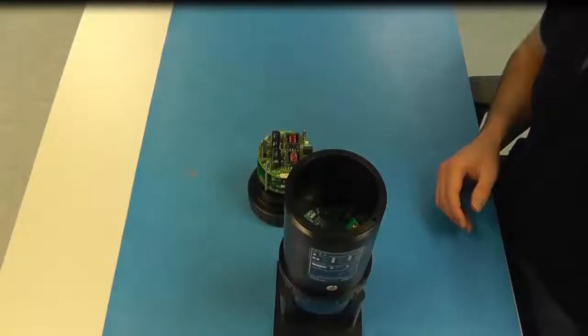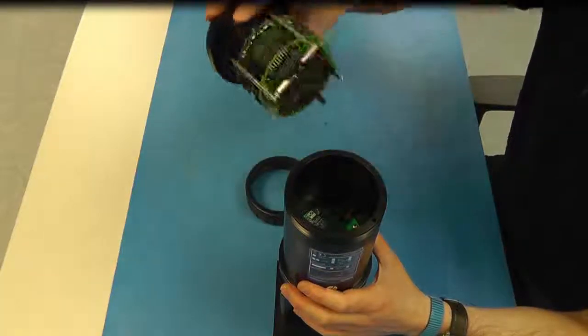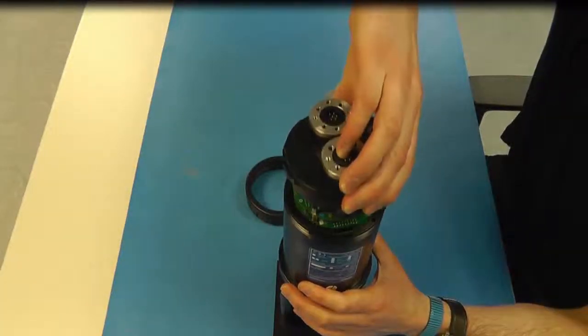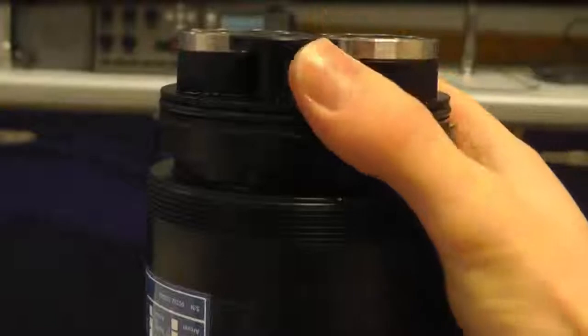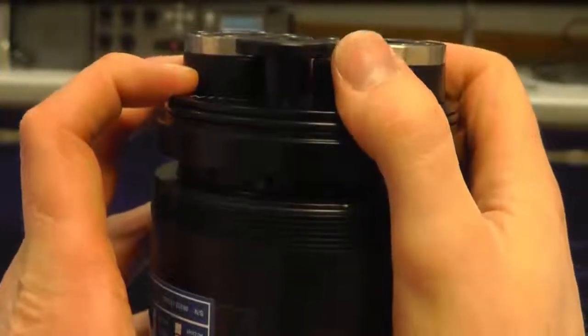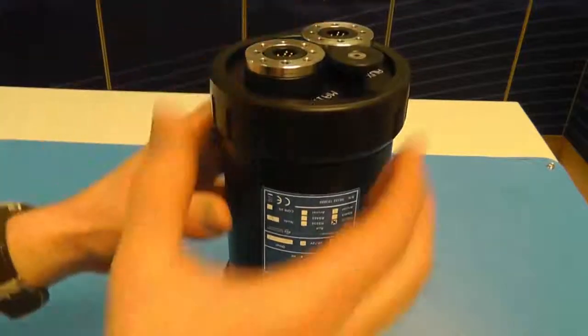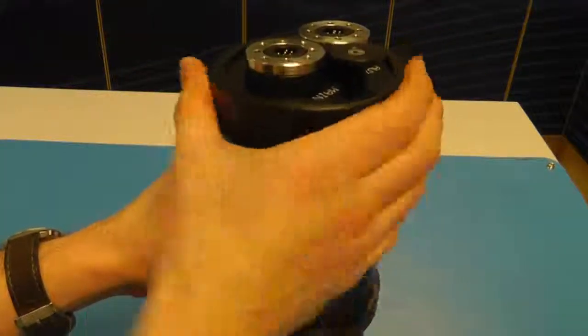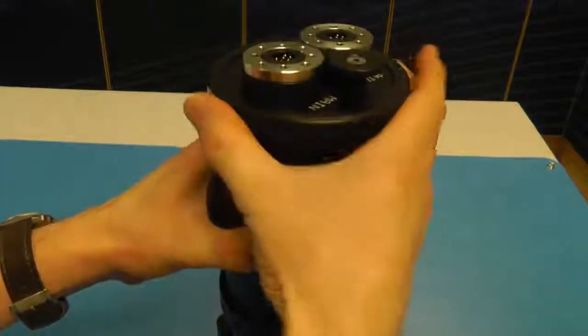Re-housing the board stack. Carefully place the board stack into the body tube. On the connector end cap, there is a guide peg to ensure the PCB board stack fits correctly. Move this to the corresponding hole on the body tube, then press firmly down. Fit the locking ring and twist it clockwise until it is secure. Care is to be taken when tightening the locking ring to avoid damage to the threads.